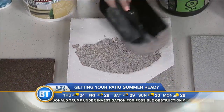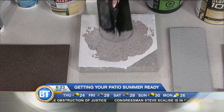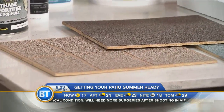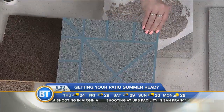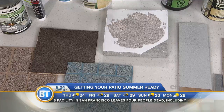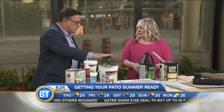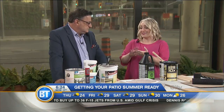It's a really easy product to apply and pretty quick. Everybody has that cement front and thinks 'I can't smash up cement, I can't pour cement — it's a huge job.' But you can just do a fix instead. You can even use tape lines on the base coat of the porch and floor product to make it look like detailed patio stones. The caveat is: if you don't know exactly what you're doing, ask at your building center or hardware store — the people there are dying to share information about primer, brushes, and trowels.